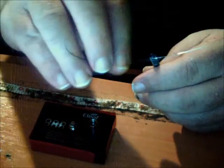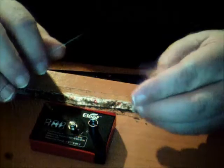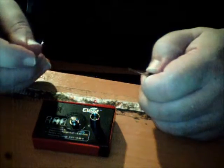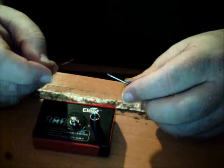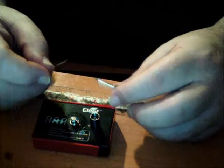What I've got here is an 8 inch piece of Kanthal A1 24 gauge. I'm building this coil to 0.55 ohms resistance, and the reason I'm doing that is when you want to get a little fancier and use two of these, it's going to come out to 0.275 ohms resistance. 0.27 will work on pretty much any regulated mod you want to use. As for mechanical mods, you're on your own — learn to build your coils first.